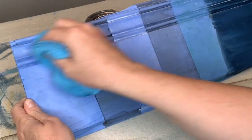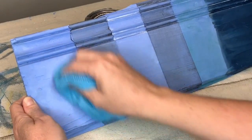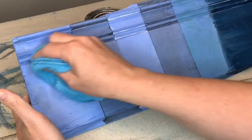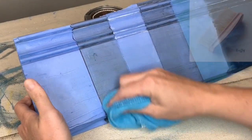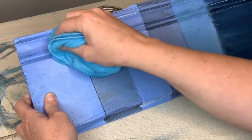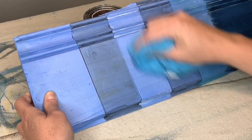The last and most important step when waxing is to buff. I usually wait until the next day to buff. Make sure to use a lint-free cloth or a buffing brush, and you will see the most amazing transformation take place — as you're rubbing, the entire piece will start to shine.